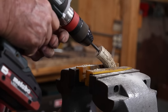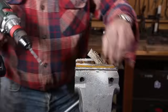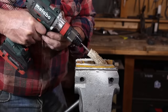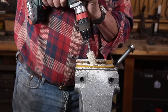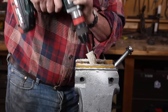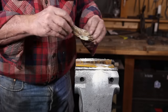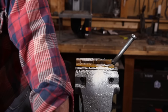I don't want a perfect fit for the tang inside the antler. I want to get rid of all of the pith that's in the antler because that's weak and it will not hold up well in long-term use or hard use. So I want to get rid of all that. We'll epoxy the blade in and that way it'll be good and solid. I think this is way better than trying to get a perfect fit and then having that pith collapse later on. Remember to check it every now and then to make sure it's going to fit.